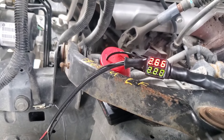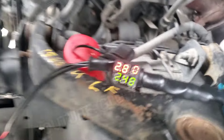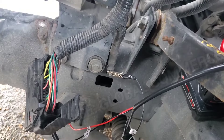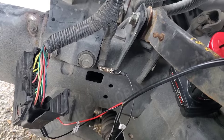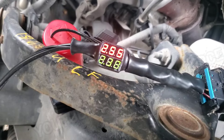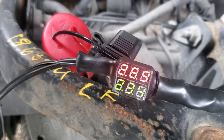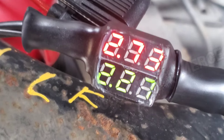We're using the Ultimate CAN Bus Tester to go ahead and test the data lines. As you can see, we already plugged up and tapped into the front of the connector. We've got our ground right there so that we'll get accurate readings. The CAN high and low signals look pretty good. My scanner's connected up here and I'm now going to attempt to connect to the network. We've already tested all the powers and grounds — that tells us the problem is going to be the ABS module.